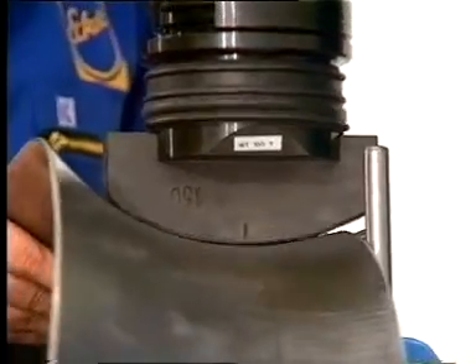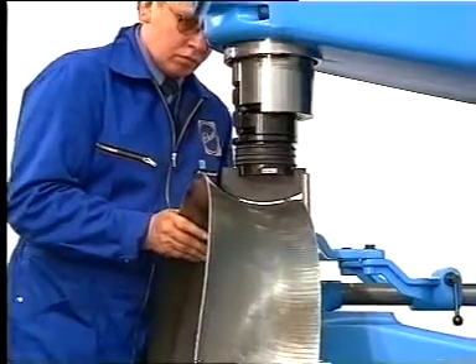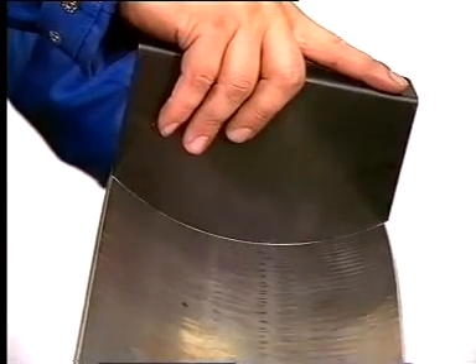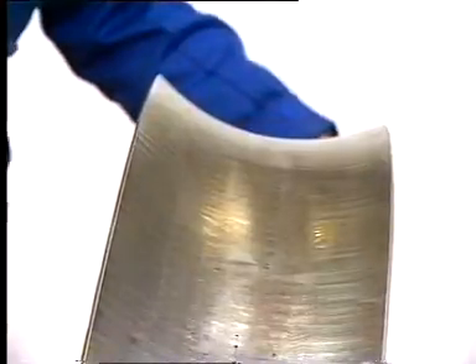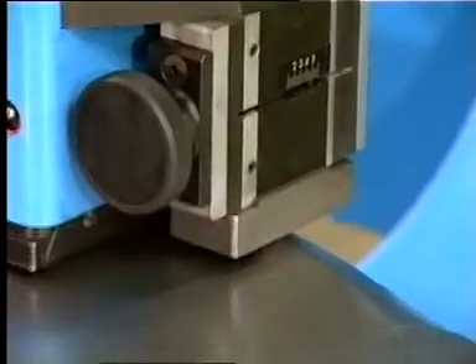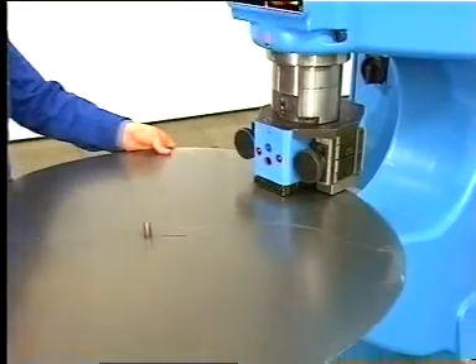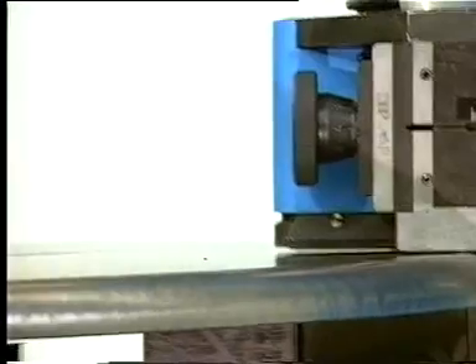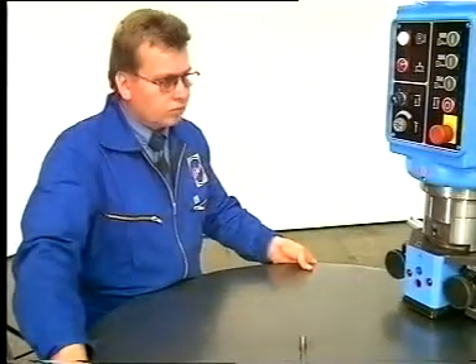The second step then achieves the desired result. The reformer gives the workpiece its precise radial contour. A template is used to check the precision of the final result. For upsetting flanges to a maximum of 90 degrees, we have developed a special flanging tool. Various different tool inserts, so-called hammer and anvil, are employed to achieve the desired flange radii and heights. This tool also allows workpieces other than round ones to be finished.